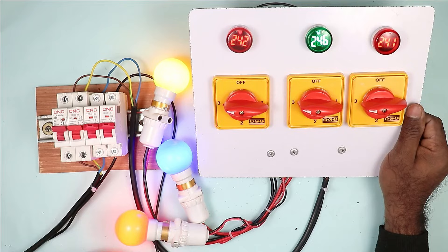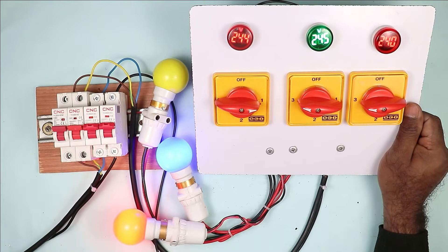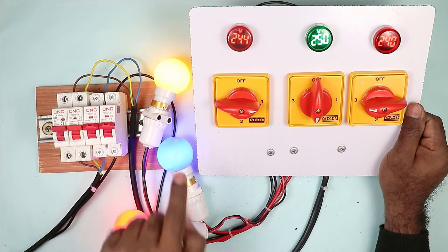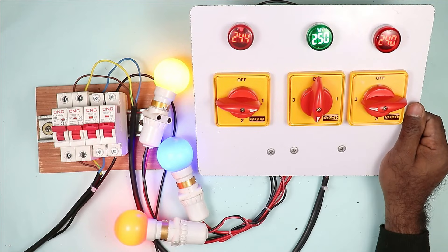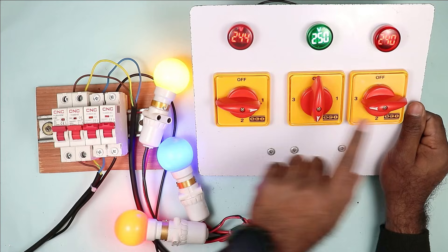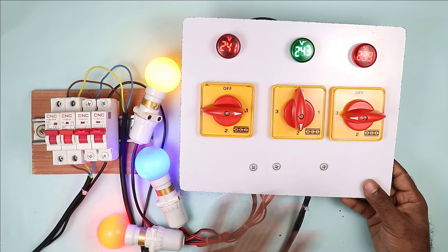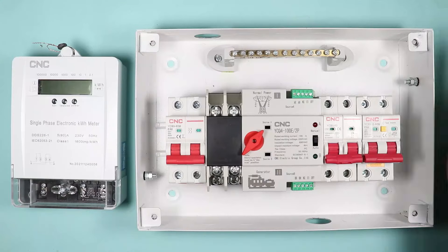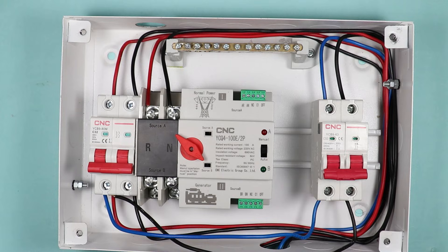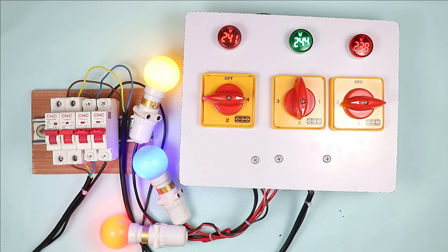In normal condition, do the connection of the first floor with R phase power supply, the second floor with Y phase, and the third floor with B phase. In normal condition, you have to select selector switches at position 1, 2, and 3. So how this changeover switch works — I explained this to you. Friends, if you want to learn how to do connection of an auto changeover switch in a distribution board, then click on the right-hand side video. Thanks for watching this video.